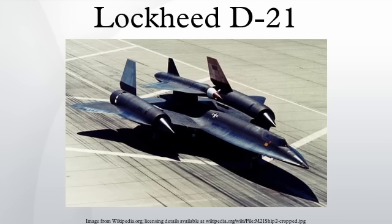The tail gunners and electronic warfare officers' stations were replaced with two launch control stations. Command and telemetry systems were added, and high-speed cameras were installed to track the drones as they separated from the pylons. The launch control officer on the B-52H could communicate with the D-21Bs and could make them self-destruct. The solid fuel booster was both larger and heavier than the drone. It was 44 feet 4 inches long and weighed 13,286 pounds, with a folding tail fin on the bottom to stabilize it while the rocket was firing. The booster had a burn time of 87 seconds and a thrust of 27,300 pounds force. During ground handling, everyone within 25 feet was required to wear anti-static straps to prevent any discharge of static electricity that might ignite the booster.